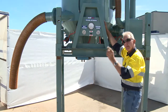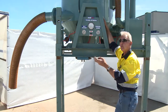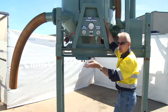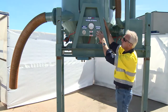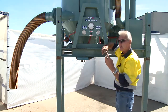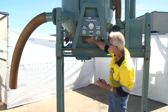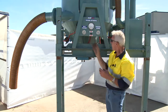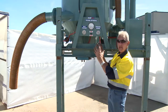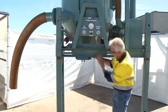If I've vacuumed up material and relative humidity is high during the day, those fines — dust, dirt, whatever I've sucked up — could coagulate and consolidate towards the conical section of the pot. To eliminate that consolidation, we also have a vibrating valve connected to the bottom of the conical section. By operating that periodically, I can make the bottom of the conical section shake and loosen those consolidated fines so they can be released through the butterfly valve at the bottom.